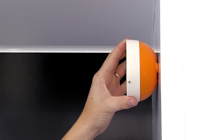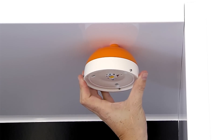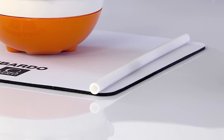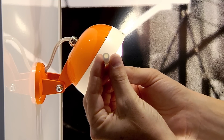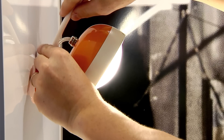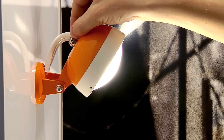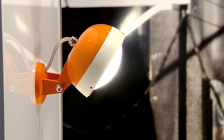The fitting can be installed on a wall straight or at an angle of about 20 degrees, or on the ceiling. The fitter will presumably use a cable for outdoor use for the wiring. If the installation has normal single-pole wires, the piece of sheathing provided with the product can be used, which is only a styling element to hold the cables — this solution does not guarantee compliance with the electrical wiring standard.